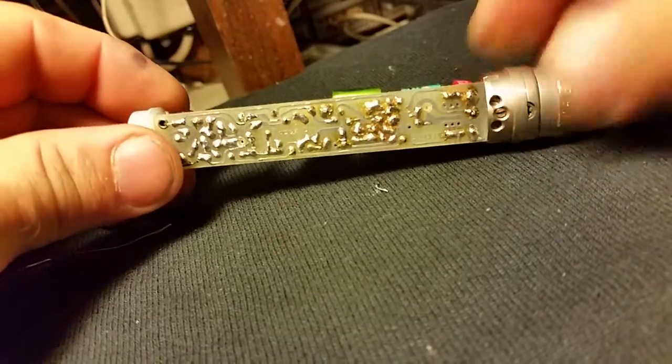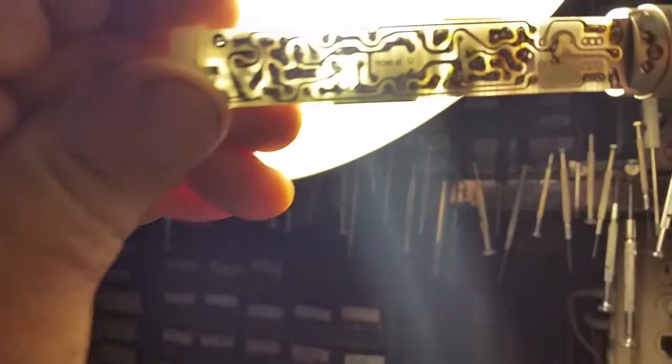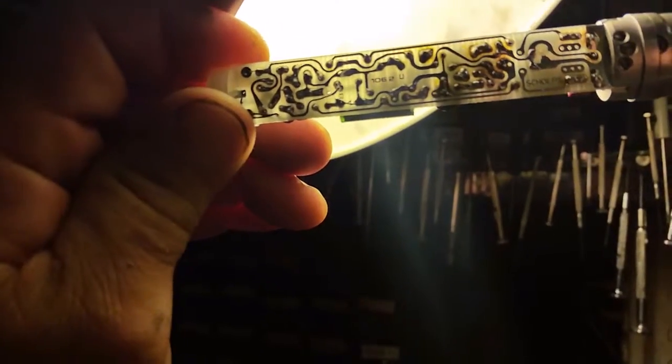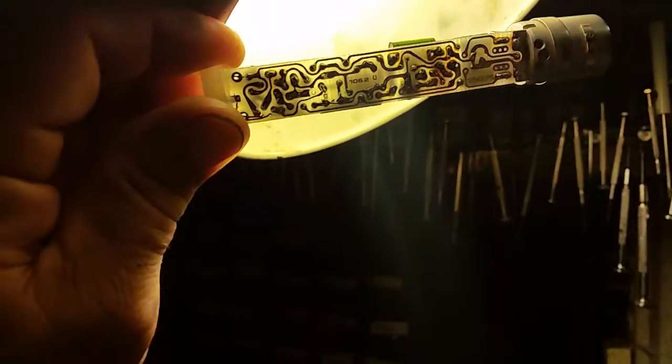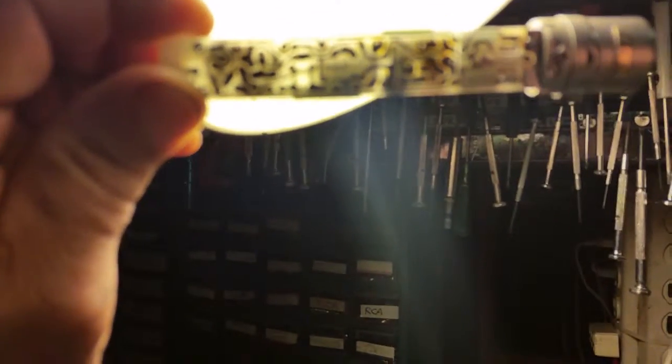Make sure your work is clean. You can often hold it up to the light — I often do this. I'll put my circuit board up to the light and examine it to make sure that I haven't created any solder bridges. And there you can see the B to A with the light shining from behind.